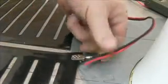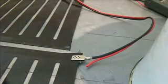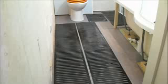Once the cable's clamped in place, give it a jolly good tug to check that it's never in a million years going to come out. The elements are wired in parallel, by the way, and the combined length of the element in any one run shouldn't be more than 7 meters.